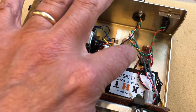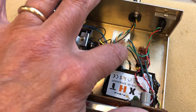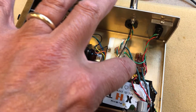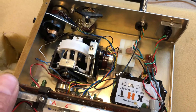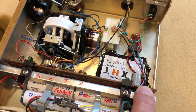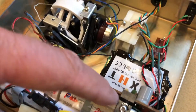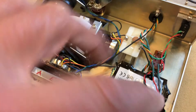I simply put a 10 kilohm resistor in line to the power. The rest of the lines I didn't change — the only thing I did was replace that line by putting in the resistor and getting the power off the main board. The XHT gets its power off the main board; there are positive and negative connections coming off from that board, and the signal wire — I found the spot coming off from the bottom.